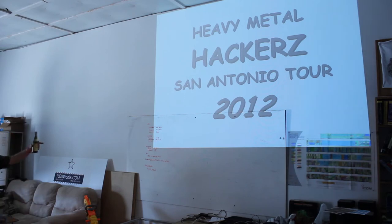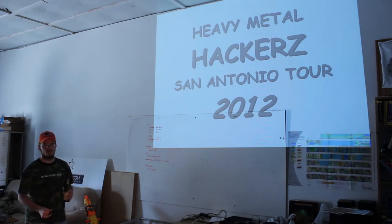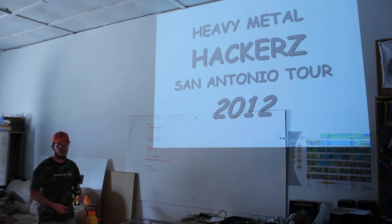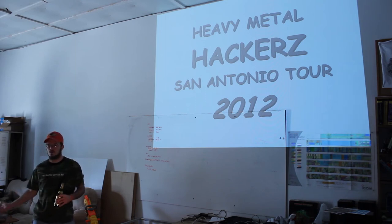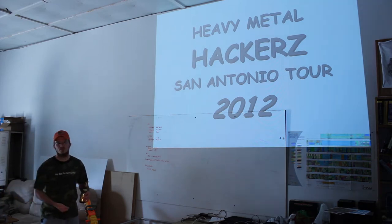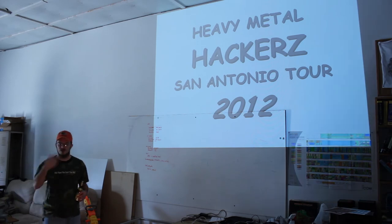So, Casey, how much is a MIG welder? The cheapest one, you can get a cruddy one from Harbor Freight for $200, $250, something like that. I got a pretty nice Hobart over there. I paid $600 for that one. It's got name brand recognition. It's smooth. It's clean. You kind of feel confident with it. At the same time, I regret not buying one that had an aluminum spool on the gun. We'll get into that later, but with an aluminum spool on the end of the gun, aluminum becomes possible with a MIG. Theoretically, you can push it through the umbilical, but good luck with that. Aluminum is very soft and it just binds it. What you got, Rob?